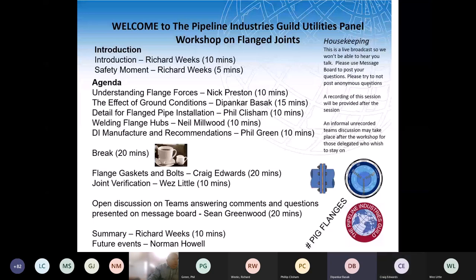It depends on how much the stress is. If the pipe is rated for 16 bar and it is running at 15 bar, then probably this is not worth taking a chance. You're better off providing them. So there has to be an engineering judgment. It's not really a straight answer that you can't do this or can do that. It might depend on diameter as well. Correct. With small diameter pipes you probably get away with it, but large diameter, no.